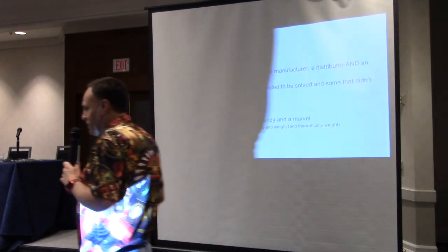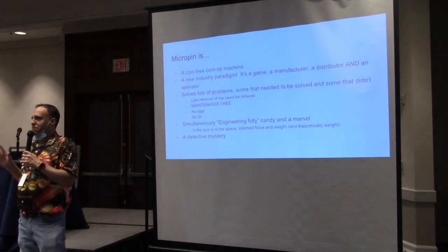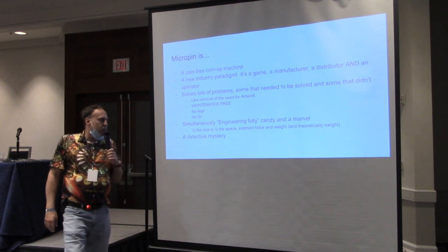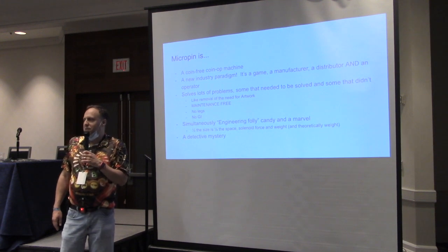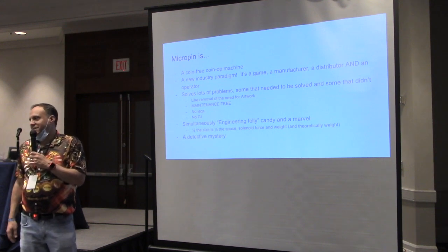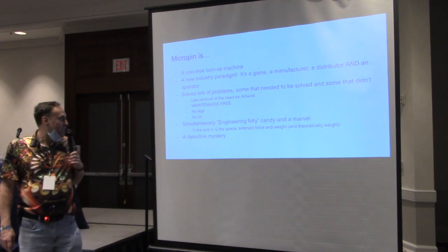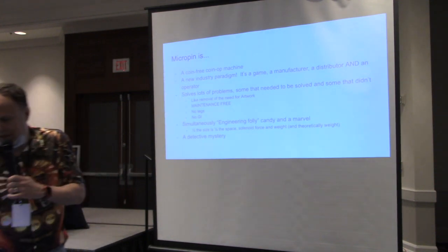As I've owned this thing and looked at it, what I've learned is it's kind of a combination of things. One of the favorite things about being an engineer is laughing at bad engineering. If you look at conversations at work, almost all the laughing ones are about bad engineering, and there's plenty of that here. But there's also some really cool ideas that are ahead of their time. One of the things you think about is 1/2 scale, which is what this game is. Half scale means 1/8 the volume, right? So your ball weight goes down by 1/8, which means you don't need very large solenoids to propel the ball anymore. Which means, in theory, it's 1/8 the weight. It's not. It's 1/3 the weight. That sucker's 60 pounds. So it's kind of this combination of things. And that's why I've been so fascinated with this.